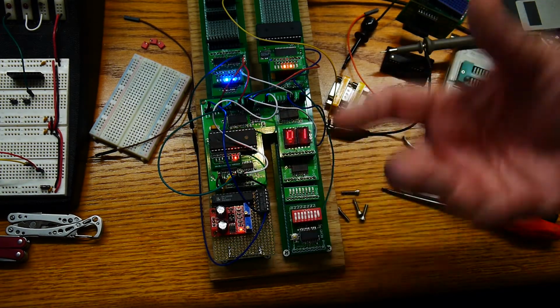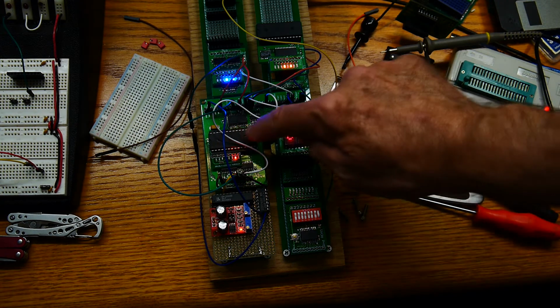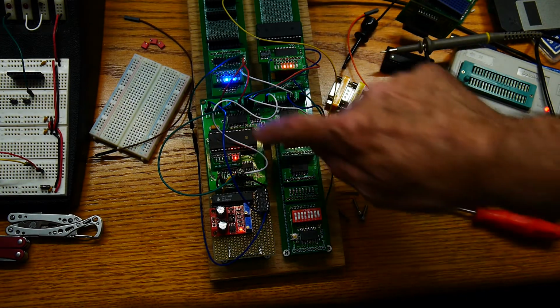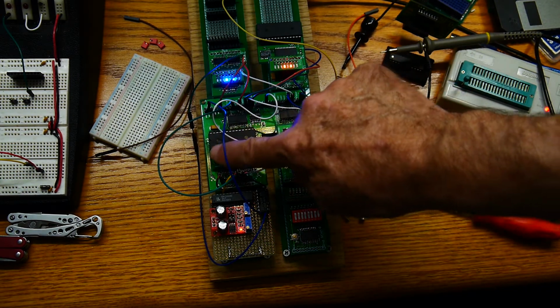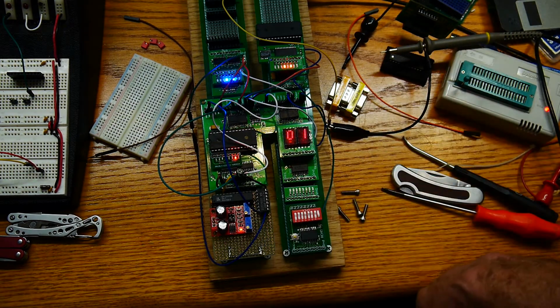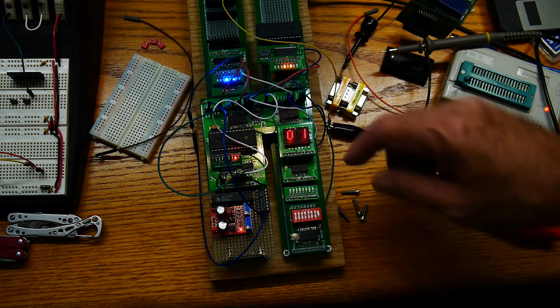The problem right now is that if I get some random instruction, let's say FF or something, I don't have 128 or 256 instructions loaded into this ROM yet. I only have 3 or 4. I need to burn all 128 instructions, at least with those first 2 bytes, in order for the thing to clear correctly. So I need to figure out how to do that. I'm not crazy about typing that much, but with copy paste, maybe it'll be okay.